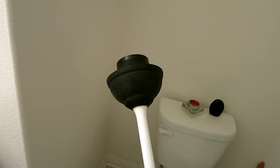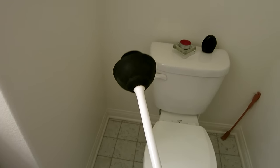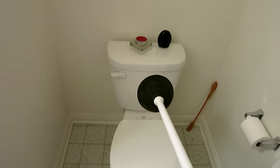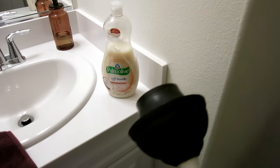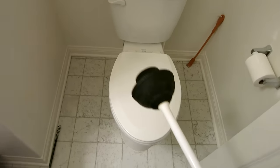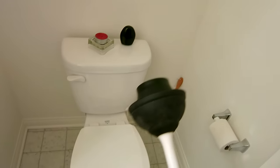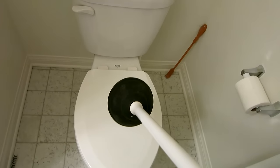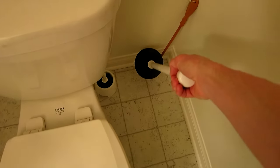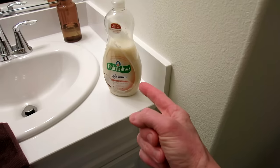The next one is the most simple — a plunger. For a good one like from Target or wherever, you're going to pay a little bit of money, but it is an investment and these work fantastically. The only reason I'm having trouble and even making this video is because this particular clog on these new eco-friendly toilets — they're so small — the plunger did not work. So we're going to be going with the auger, also called a snake. With a plunger, once the water level goes down a little bit, you just seep it in there, plunge away, get some air in there, and it'll go down. This technique takes a little bit of time, but if you're stuck at two o'clock in the morning and don't feel like going out to the store, it might be a decent option.